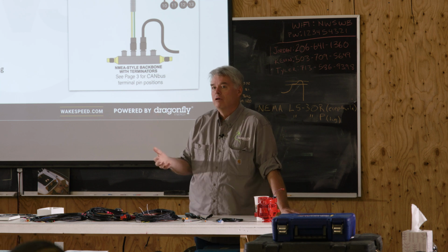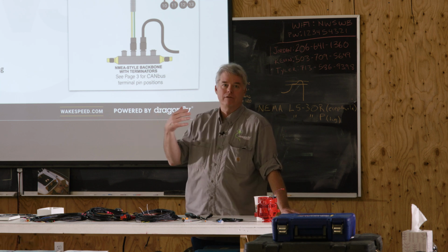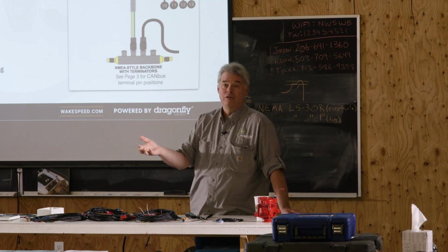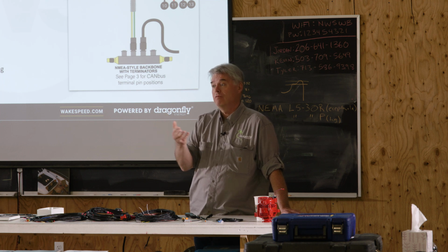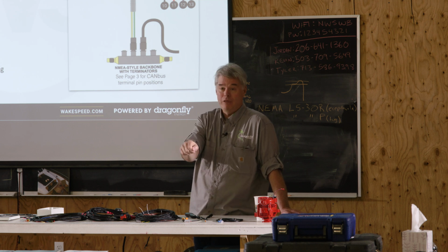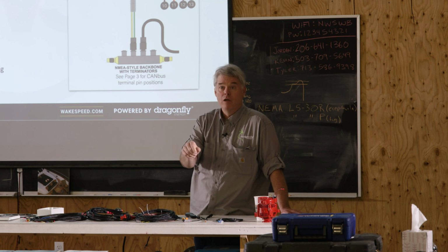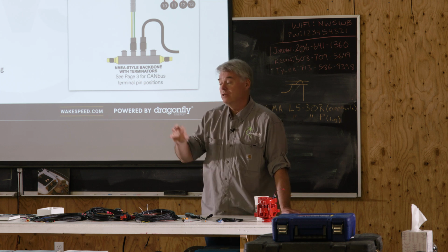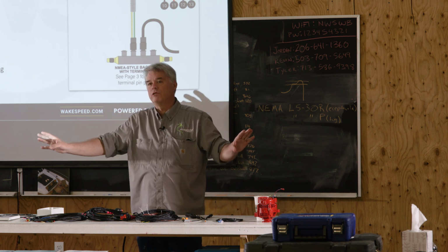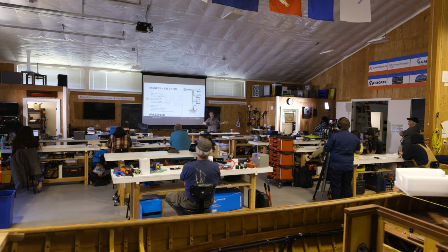So not at the limit, but because of the battery he chose and because the batteries normally heat up, one battery, by luck of the draw, was the warmest of the whole bunch. In that particular case, we consulted engineering, and they recommended, because the customer had taken detail on each battery, putting the battery temperature sensor on one that's more in the middle, representative. What happened in that very specific case is that warmest battery, when he reached his limit, turned off, but the other 7 batteries were still there, and we continued charging them. So the system worked well and safely, but the problem the customer was having is just by chance he picked the battery that was the overachiever of the bunch. Okay?